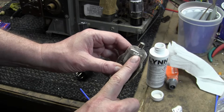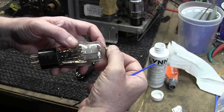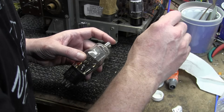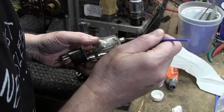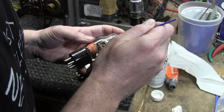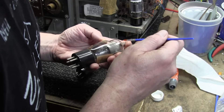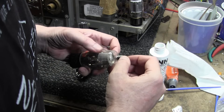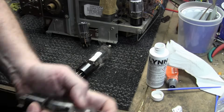Now this plate cap — there's a wire coming up through the top of the glass into this cap, and then it's soldered on with a blob up top. Ideally there's some old material in there, and I can see there is still the old bonding agent down in there, so I'm going to lay a thin bead down inside it. If the cap had completely broken off without that residual material, I'm not quite sure what the best approach would be — you'd want to get some kind of filler in there and not just rely on this.